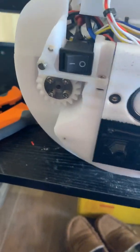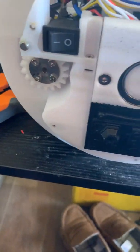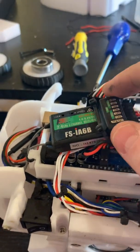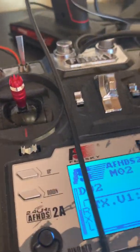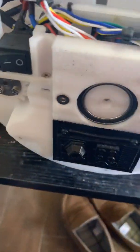What I wanted to talk about was when you first power this up. Don't power it up with wheels on, because the first thing you've got to do is try and get the IMU controlling the motors in the right direction. The way the coding works, it wants to see a signal from the RC receiver first before it will fire through. So the first thing to do is turn your receiver on and make sure you've got everything where you need it, and then after that you can power up.